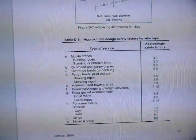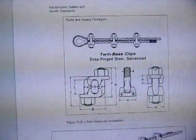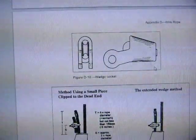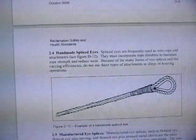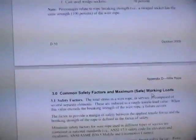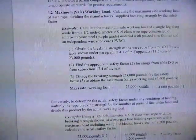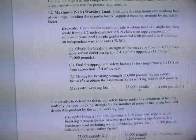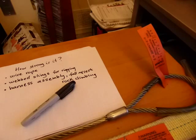Safety factors are covered in another video. There are also wedge sockets and handmade splices as possible terminations for wire ropes. Here's a sample calculation: you have 6x19 wire, you consider which steel it's made of, and work with those numbers — it's quite a process. Bottom line: wire ropes are composite products. If you lost your tag, it's going to be a lot of effort and often a lot of guesswork to figure out how strong your wire rope is. Tragic story.